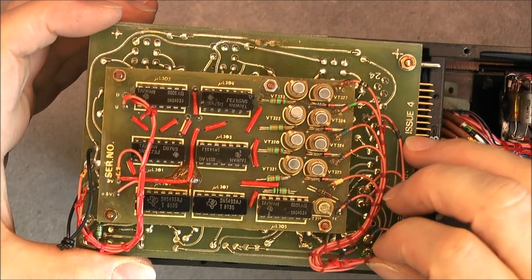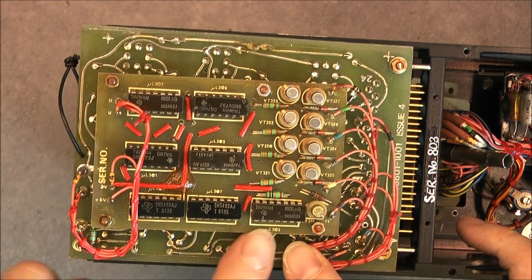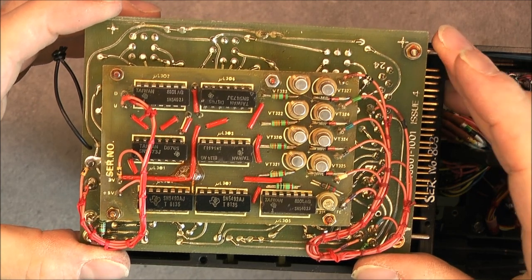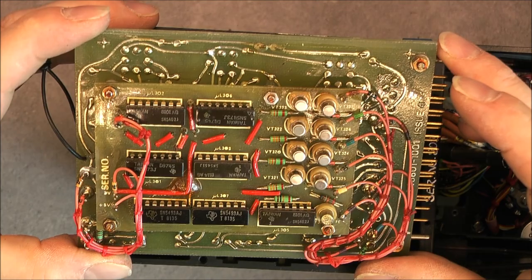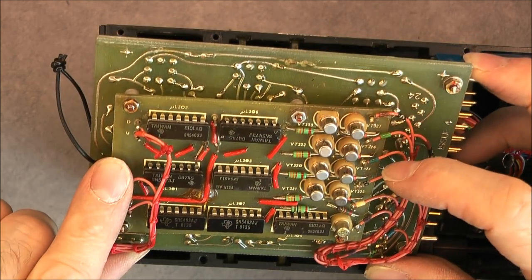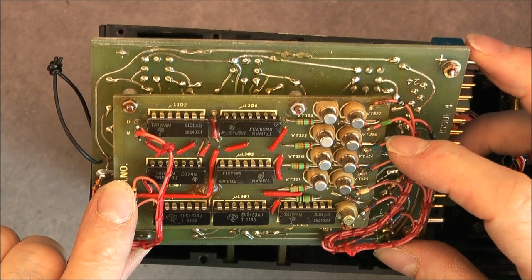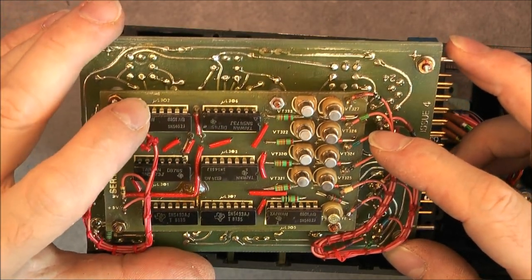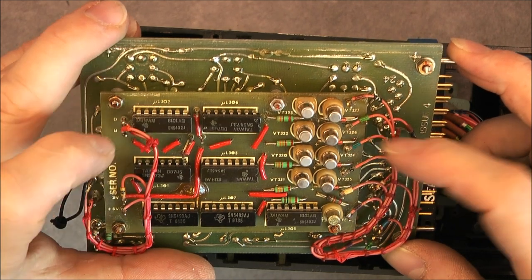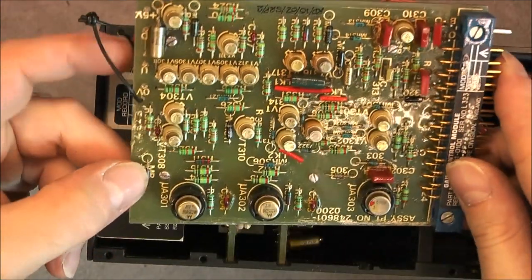The gain control module. There is a whole bunch of transistors, mostly. Some op-amps here. A servo loop of some kind. I see Texas Instruments SN54 series. A whole bunch of additional transistors. Ceramic sandwich military-grade ICs. Nice gold pins on this connector and thick conformal coating. You can notice the wires interconnecting this board to the next one — they did not use pin headers. Quite tedious work to put together, probably. We have plus five volts here indicated. Is it some kind of analog-to-digital converter? You can notice the inventory labels of ICs: Micro L — maybe for micro logic. The transistors are labeled VT. Very old school.